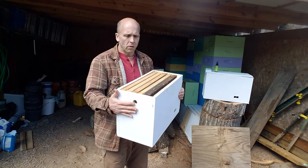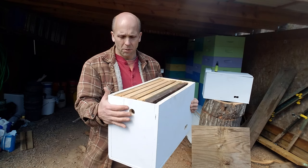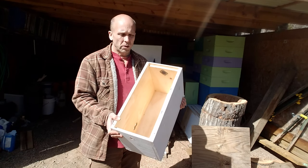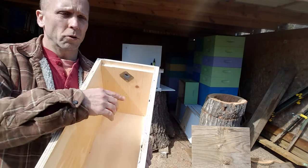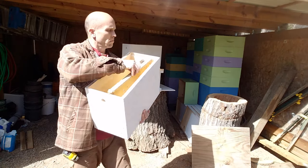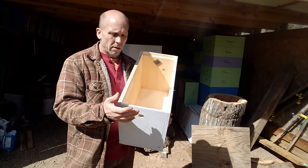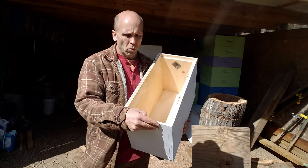On the ends you need to either make a rabbit cut so you have a ledge for your frames to sit on. Here's the box empty — this is actually the second one; I made two of these and I've got enough material to make two more. You can see the ventilation hole on the inside with the screening, easy to staple. You can also see the rabbit cut right here — the ledge for the frames. You can stack material and fasten it with staples or screws, or if you've got a router or router table you can do it that way — that's how I did it.